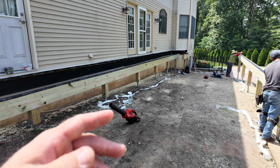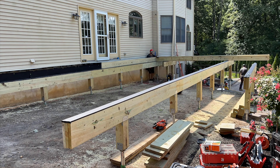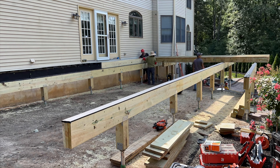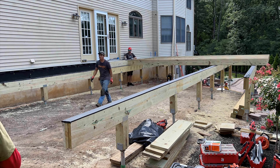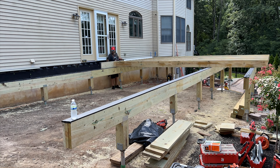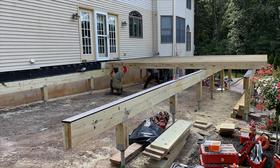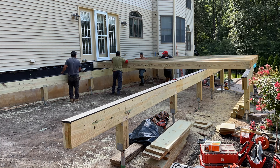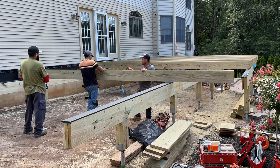Ideally I'd like to start at one end and work our way across, but our access point is behind us so we start at the far end and work this way. Now we're finally installing some joists. I rested what you could call the ledger or rim temporarily on the drop beam, and I'm nailing from the back into the joists. I have two guys carrying them because they're 2x10 by 20 feet long and pretty heavy. As we go to slide it into the house, that's where we notice a problem — which is why we're all standing around trying to think of a solution.